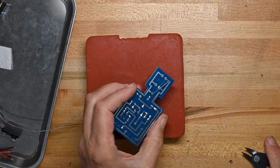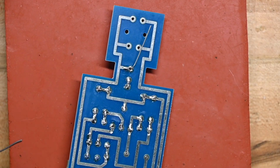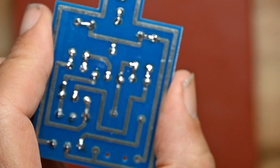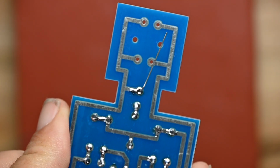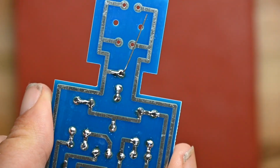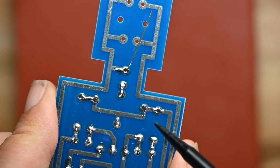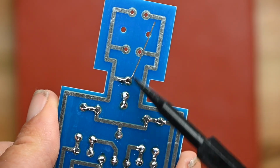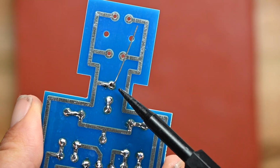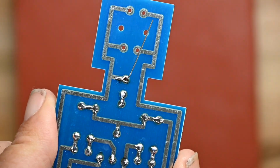Let me show you something that I overlooked for a second and happens with these older through-hole boards. I'm going to zoom in, really see how close I can get here. Oops, jerking the camera around, I'm sorry. So look at this solder joint that I've got in the center right now. You may be able to see that there's an unfilled circle there. Often on these single-layer, non-plated-through-hole circuit boards, if the wire is a lot thinner than the circuit board hole, the solder will just create a ring around it instead of flowing over it, as you can see with the other ones I have there.